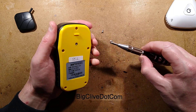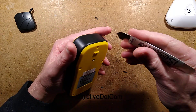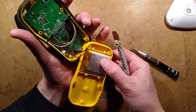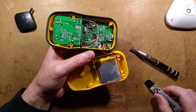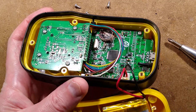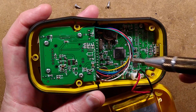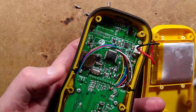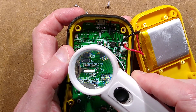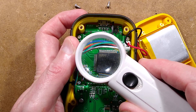Let's see if I can open this up — do I have to unscrew them some more? Let's get the spudger and apply some gentle pressure. It parts there. So here we have a very big lithium cell. I'll zoom down so you can see. We have a backup battery — that must be for the timing — and there's a little quartz crystal for timing as well as the main processor. Is it an Atmel? Let's get the magnifier out. It's an ARM processor: STM32F103RCD6991G2.